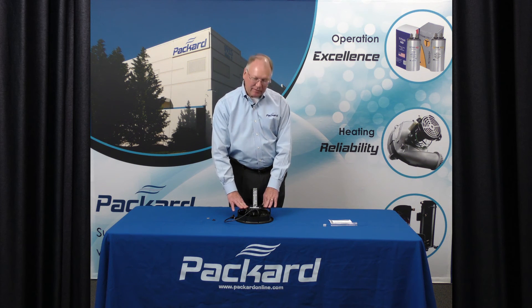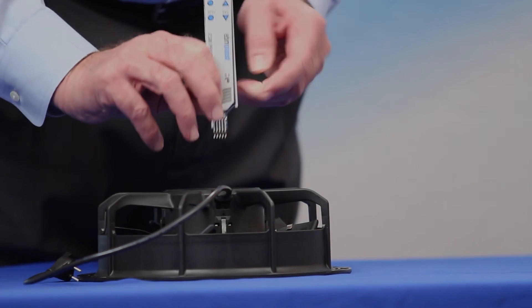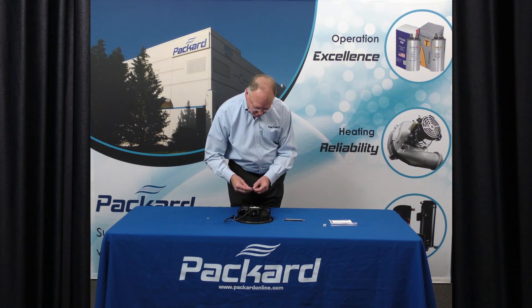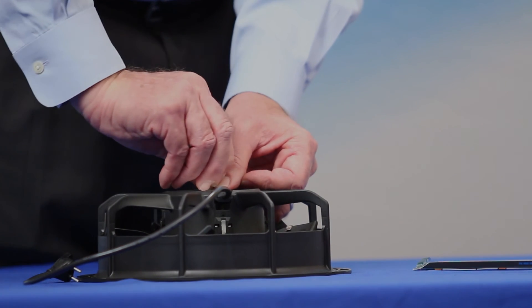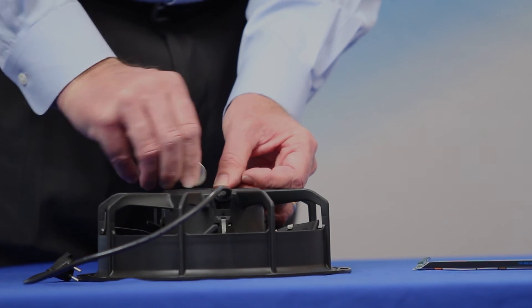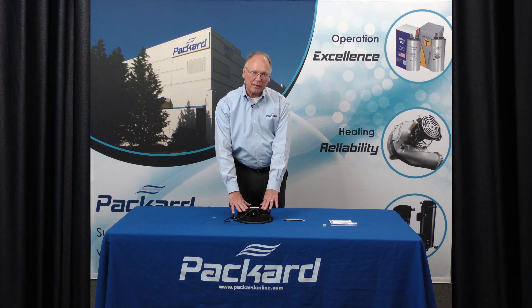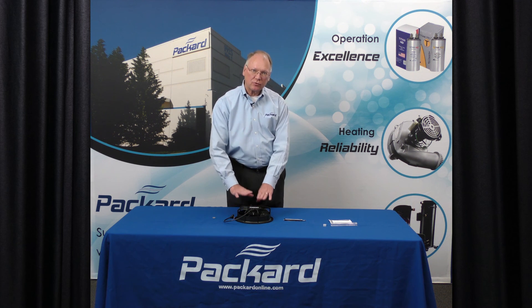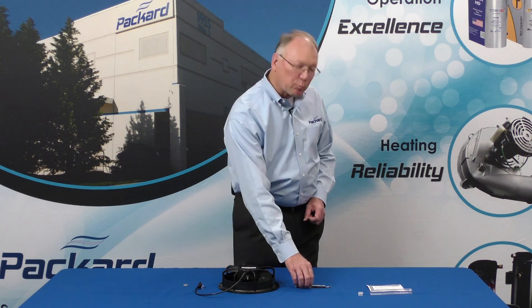After my speeds have been set, power the nano programmer to the off position, pull it straight up out of the motor, and replace the plug in the back, securely tightening it to protect it against any possible moisture or water. And always, always remember: when using the nano programmer with the assembly, there never should be power applied to the assembly — it's always with power disconnected. After following these steps — selecting the right voltage of motor, selecting the proper cord set, and properly setting the speed — the units are ready for reassembly.